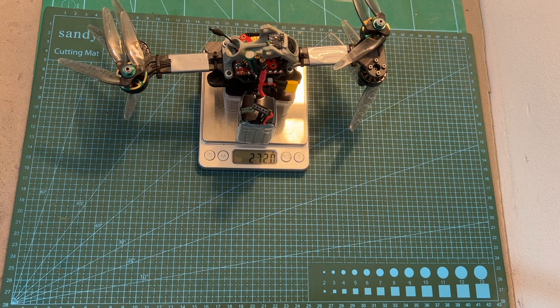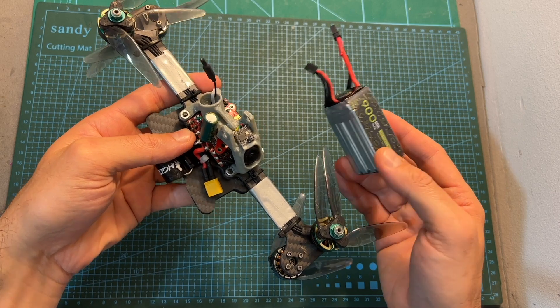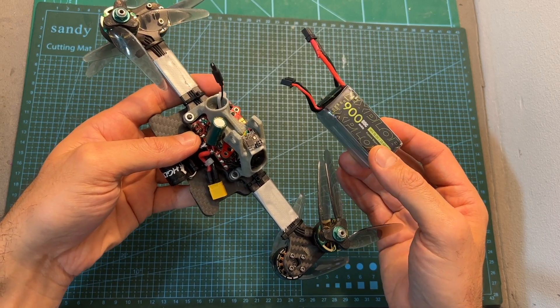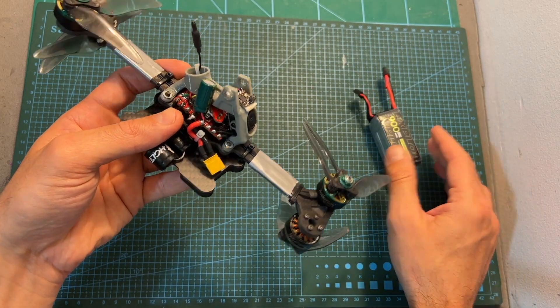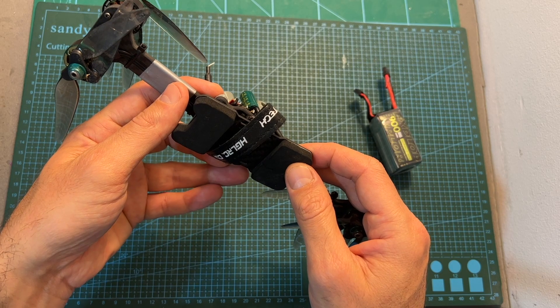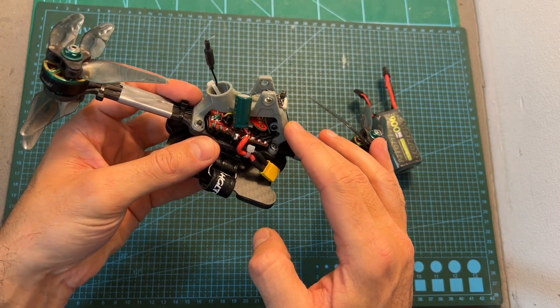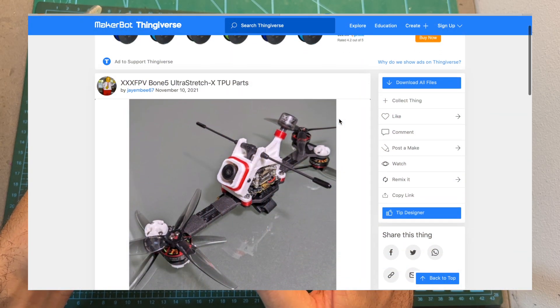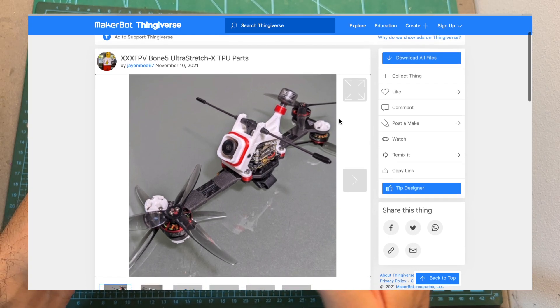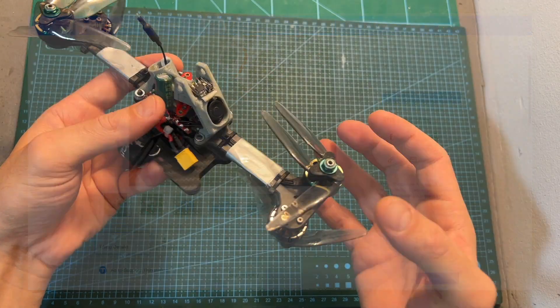Including a 900mAh 4S LHV battery, which should provide roughly 5 minutes of fly time, the total weight is 272 grams. This configuration is not a sub-250-gram build, but if you'd like to make it lighter you can use a smaller battery and avoid the bottom battery protector. Also, this canopy is not compatible with the Caddx Vista digital transmission system because it is too low — if you'd like to make this build digital, you'll need to 3D-print your own custom canopy, which is linked down below.